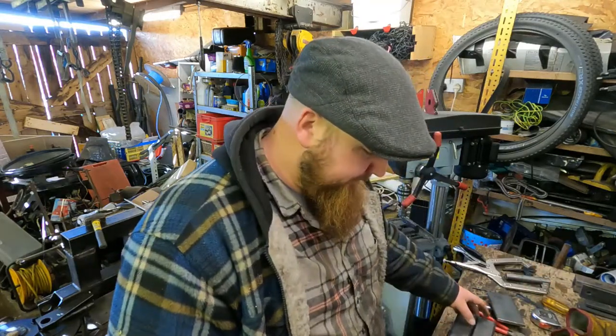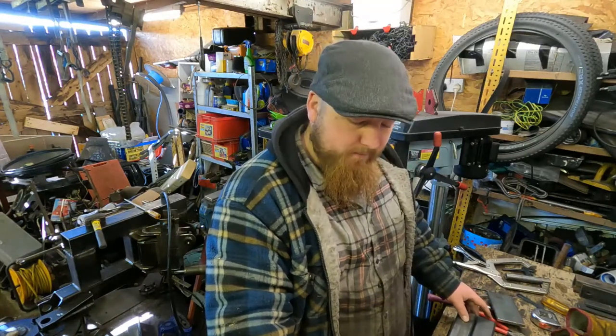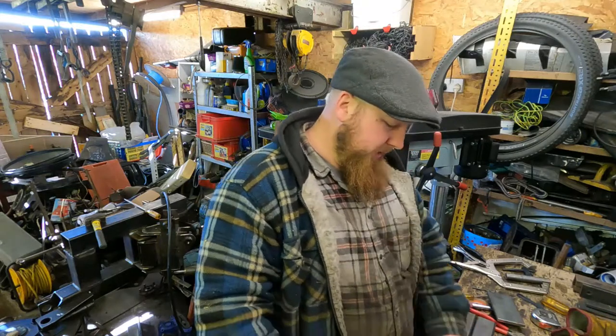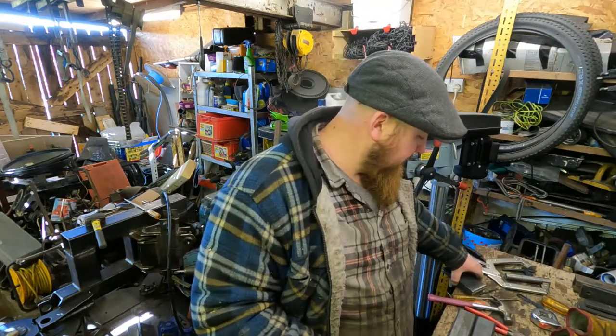So I've cut the legs. Yeah, it would be easier going 80 mil, but I'm not bothered. I'd still have to put it out 10 mil anyway in the bushings, so I'm not that bothered. So let's weld some, we'll make it robust. We'll weld this 10 mil plate on as well somewhere. Well, we'll get some holes drilled and then we'll weld the 10 mil plate on.